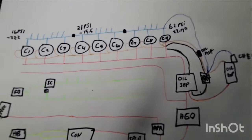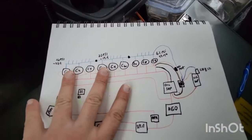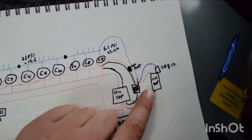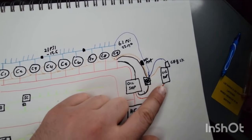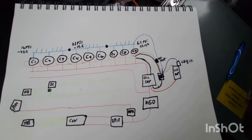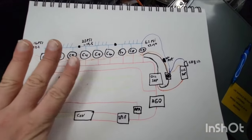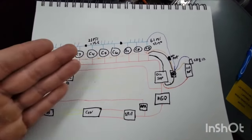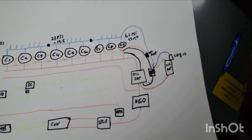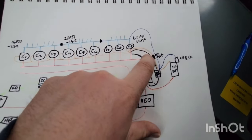Oil filter. Okay. Typically what you do for the oil, as I mentioned, is you check to see if any compressor is specifically filled up with oil. That's always your first check. Then from there, you go over to your oil separator and see if there is oil in it. If you think a compressor filled up with oil is what's causing all your oil issues, you might see that one compressor is adequately full. It might be running, it might have enough, but all the others don't. You go to your oil separator and it has two balls floating. Well, that can't be it. Since your oil separator seems to have two balls floating, more than likely it's something down the line, and I would go to the oil filter.